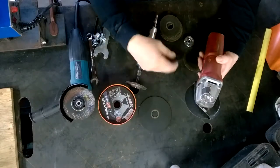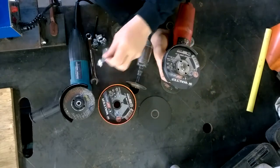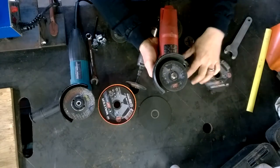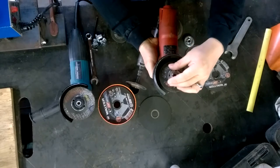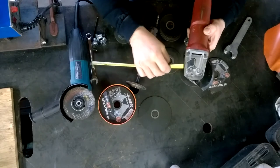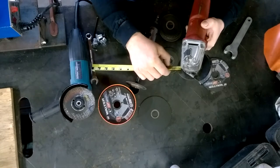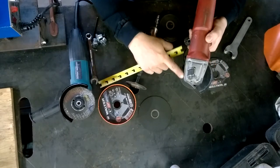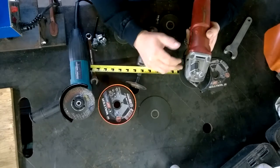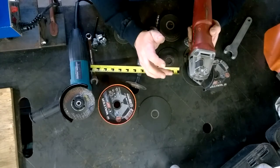What happens is you're doing a bunch of cutting and you get to a point where your cutoff wheel is worn down. You have a wheel on your grinder that's basically this small. You can see there's still about a little over half an inch until you actually start touching this edge — you have about a half an inch of cutting left. But the diameter of the wheel has become so small it becomes a little unwieldy. It's hard to maintain a straight line unless you have a cut already established.